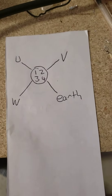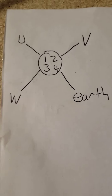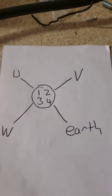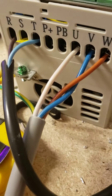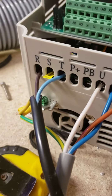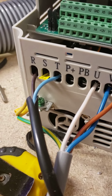So far I've worked out the pinout for the top of the spindle: number one goes to U on the VFD, number two goes to V, number three goes to W. I'm from Australia, we use 240 volt — positive goes on R and negative goes on T.